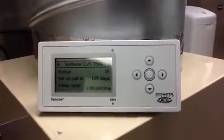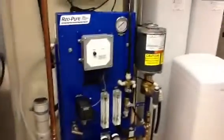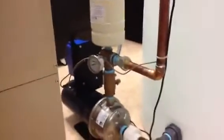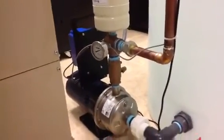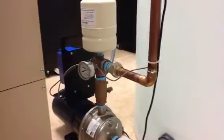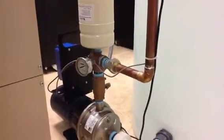This wireless remote can be put upstairs in the kitchen, for instance. With reverse osmosis, you need a storage tank for all the reverse osmosis water. Here's the storage tank — it's a 200-gallon food-grade polyethylene storage tank, with a constant pressure frequency drive pump that maintains perfect pressure by changing the frequency of the pump motor, giving the house constant pressure.